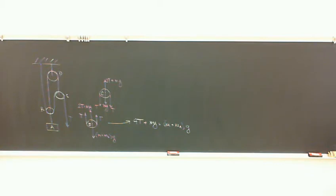And so that would be sufficient. We don't need to go up to pulley D to finish it. If you did go up to pulley D, you're adding another unknown there, so it can complicate things. But if you go over to pulley B, there's no new unknowns, and it's another independent equation.